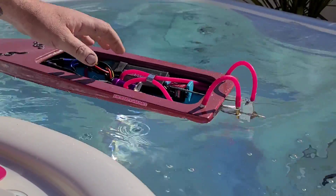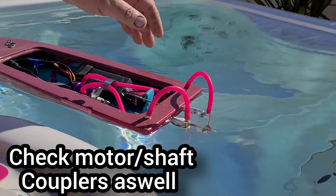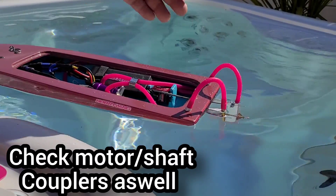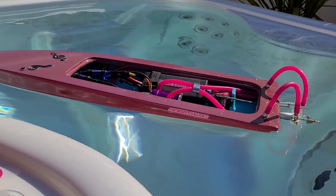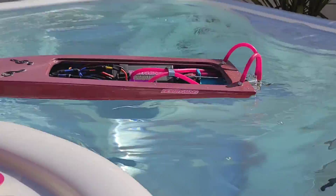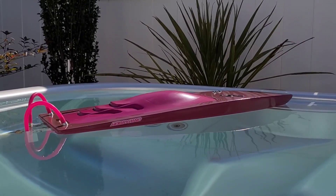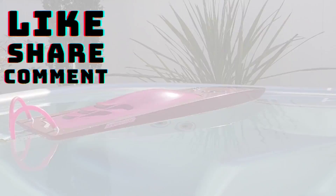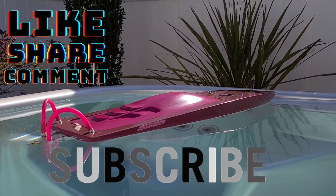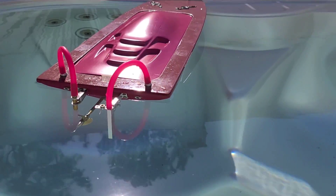Everything seemed to be fine. If we had any problems, the motor would spin up and your propeller would not spin — that's a telltale sign that your prop dog or propeller is loose on the shaft. It looks good and everything seems to be working fine. The next step is on-the-water testing, and that's going to wrap up this part of the RC boat setup. Thank you guys for watching — Big B with Ironclad RC, a channel where we tinker, test and tune everything RC. Don't forget to like, comment and subscribe, and ring that bell to get notified for future builds.